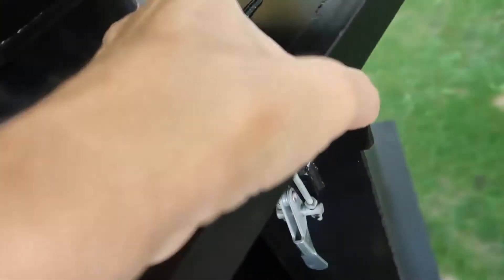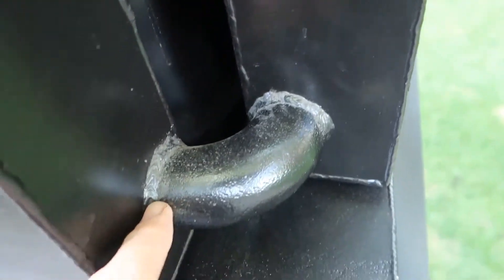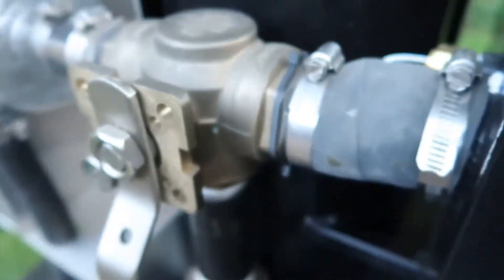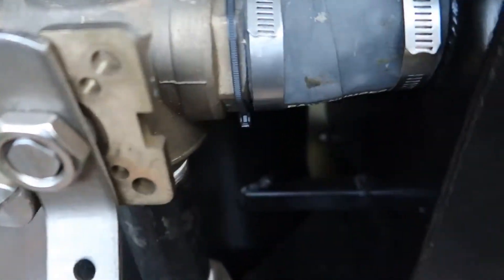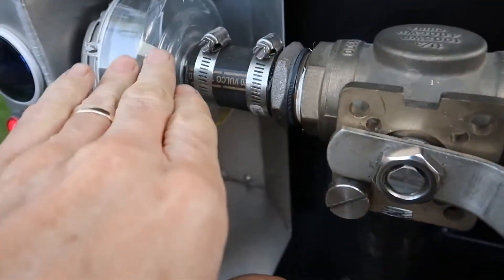The next filter is perlite — this one has perlite in it, and then this filter keeps the perlite in there. The gas comes in the bottom, up through the top of this one, down into the bottom of the next one, up through the perlite and the furnace filter, and then goes out there. When the handle is horizontal, the gas is going over here to the blower and then up through the flare.